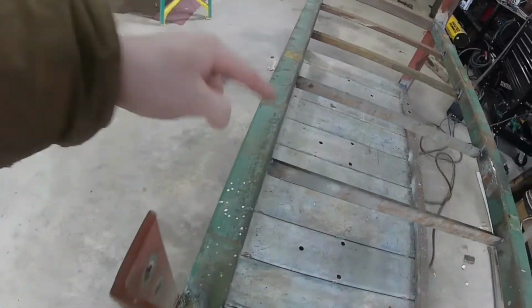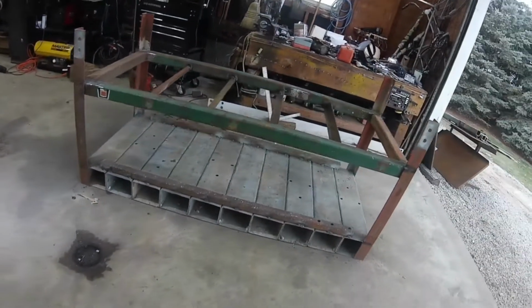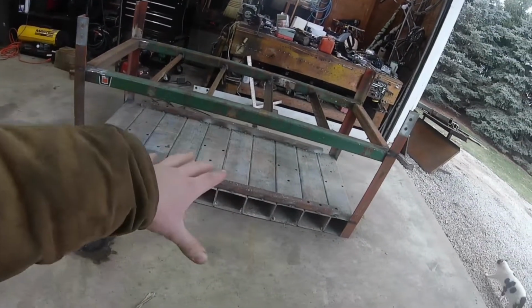We can weld the top of every one of these support braces for the shelf. Then we can go ahead and cut the 1/4 piece of steel for the top and weld down on top of that. Then grind it all down and paint it. So, we'll grab the skid steer.